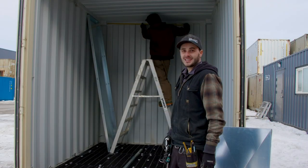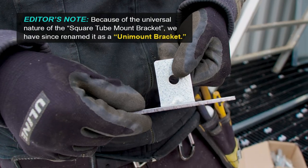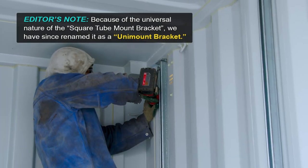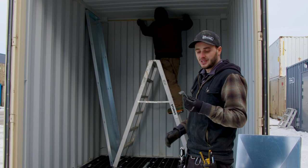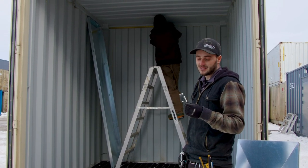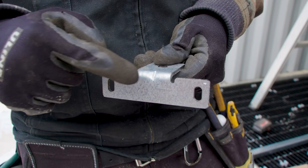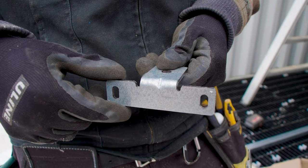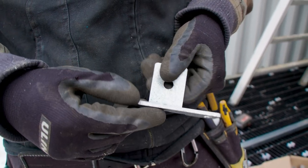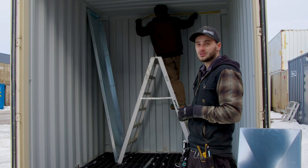We're going to do a little scientific experiment here. My hypothesis is that I can use this square tube mount bracket instead of our CSM brackets — the black ones — and strut-line this whole container for this purpose. The reason why I'd like to see if this works is they're a lot cheaper to manufacture. It's just one piece instead of two. It's thinner material, but it's strong because it has a gusset folded into it, and it's galvanized and cut with nitrogen, so even the cut edge won't rust. I'm curious whether we can come up with a cheaper solution for the public to be able to strut-line containers.